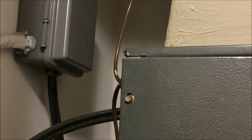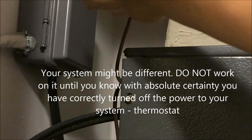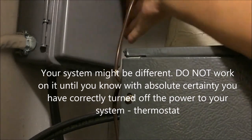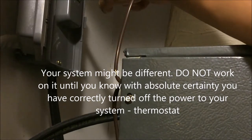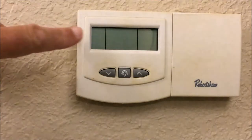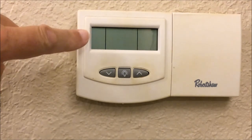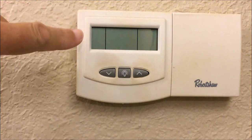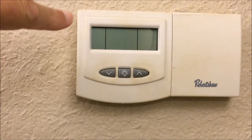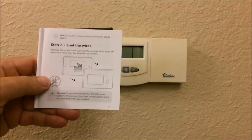What you see on screen is a portion of the HVAC system with the thermostat wires coming in and out of it, and a breaker box specific to the HVAC. We're going to throw that switch. A quick glance at the thermostat screen confirms that power is in fact shut off. You'll want to make sure you turn power off to your thermostat, because not all thermostats receive their power from the HVAC system.